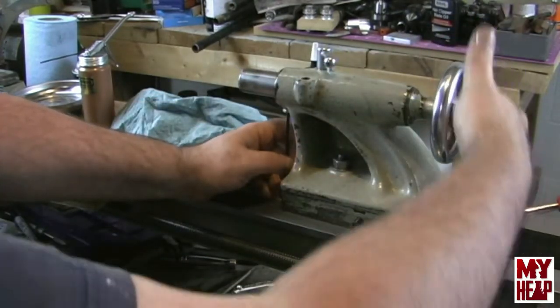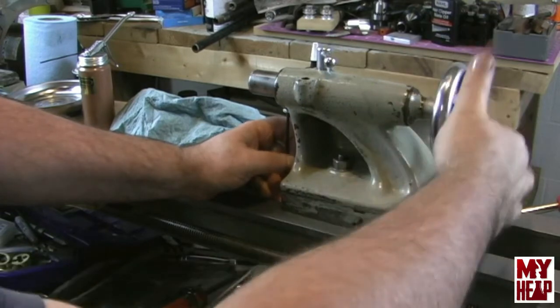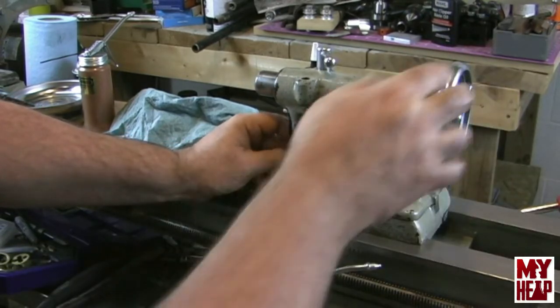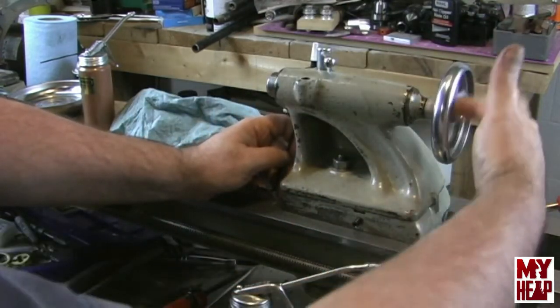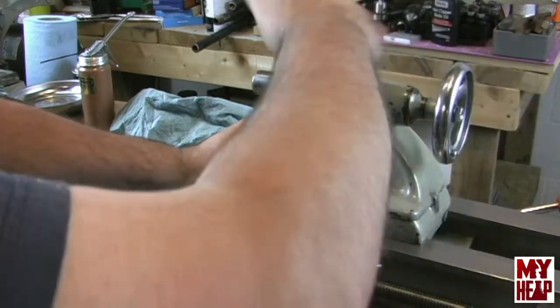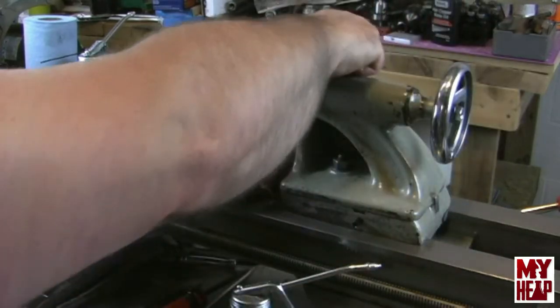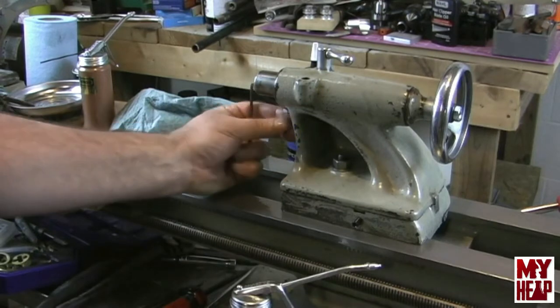Ah, that's what it was. Okay. So my nuts had tightened up and took all the end play on the shaft, and then I had my little dog point set screw over here in the bottom, which goes in the groove of the quill. I had it over tightened. So, and then we are in fact locked. So life is good. Okay, so that's pretty much it.